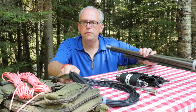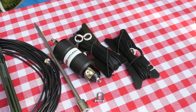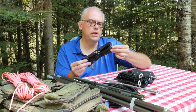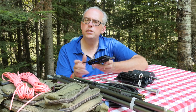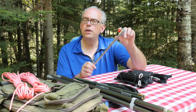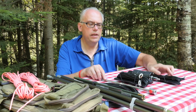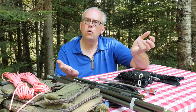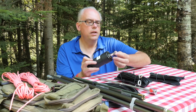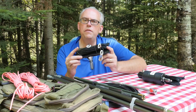Also, you receive 50 feet of coax with a ferrite choke balun on the end. The two pieces we're really going to look at today are the 73-foot wire element and a 25-foot counterpoise element. The counterpoise is used in just about all configurations. If you're using it vertically on the spike, there's a little screw you can attach the counterpoise to with a ring connector and spread that out. If you're using this horizontally, you attach the counterpoise to the base of the transformer unit, and the wire comes off the top stud.